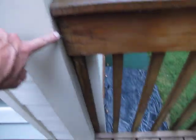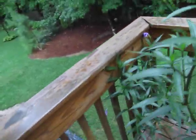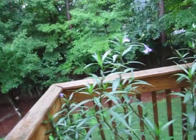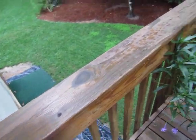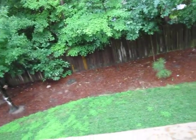The railing is attached to the house with some nails — I would rather have a 4x4 here. We'll include a quote to replace this railing. We're exploring options of metal railings. The first option would be, instead of a wood baluster, we would use round aluminum balusters that are powder-coated black, with the necessary attachments. We'll also explore keeping what he has versus removing it.